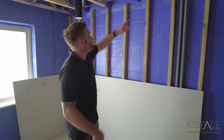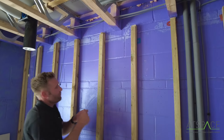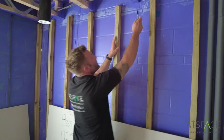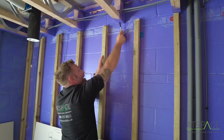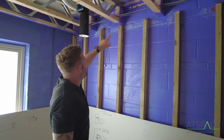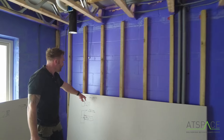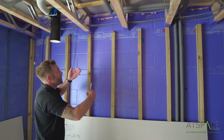One other thing we failed to mention was the joist hangers. These joist hangers are built actually into the wall. What happens is the actual hanger gets bedded on a mortar joint with two prongs that sit in it and the block work sits on top. The actual posi joist sits in a channel and bears on here. By doing that method you've potentially got 600mm centres between each one and two prongs going in. On this one run along here we've got up to 28 holes - so 14 hangers, 28 holes.